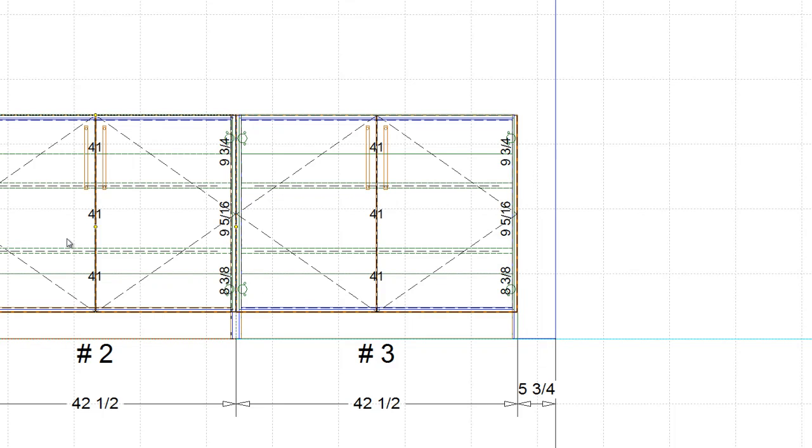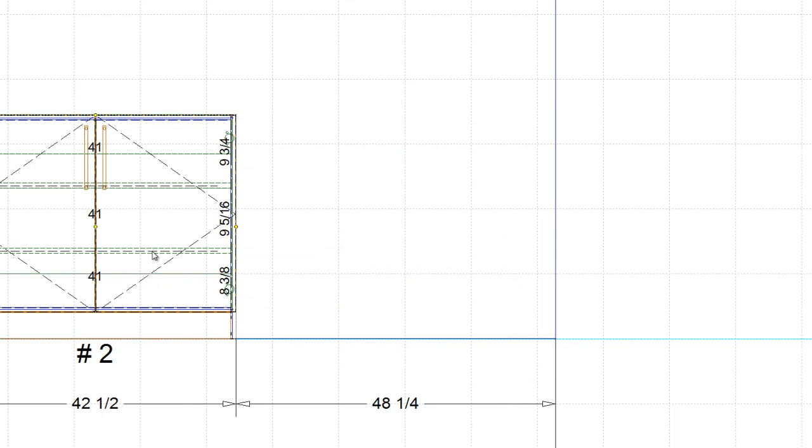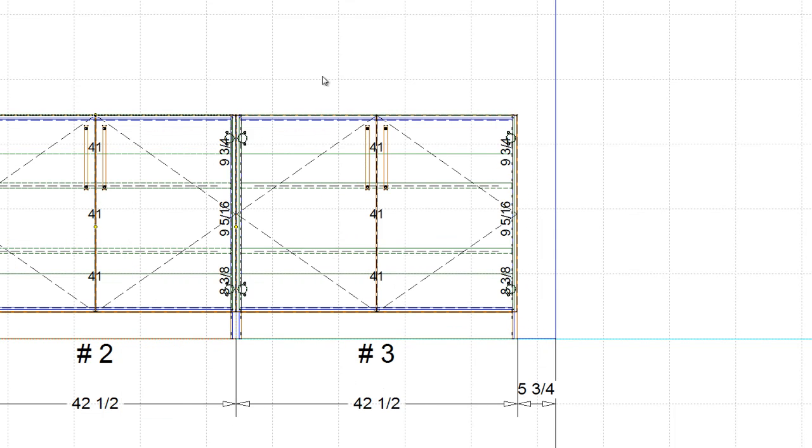In fact, what I'll do is show you how that looks here. I'm going to leave it flush just for hypothetical reasons. All right. Next thing we want to do, we just had a filler that I started off with at the wall. Now the filler is 2 inches wide and it's an L-shaped filler. So this backer piece attaches to the cabinet, and then you put this face piece on after you install the cabinet. So you can actually scribe this to the wall.